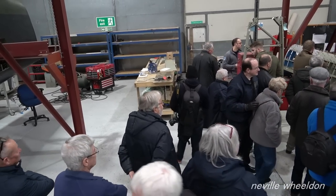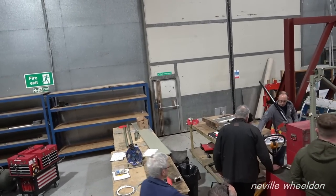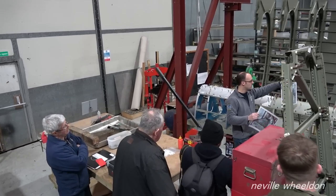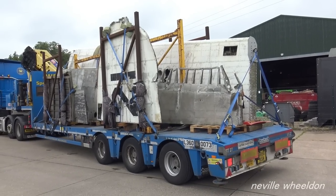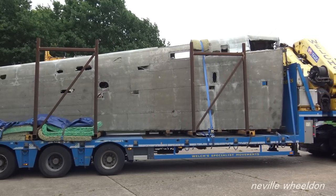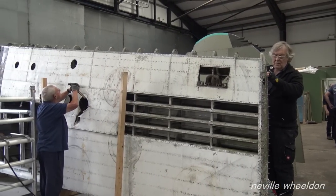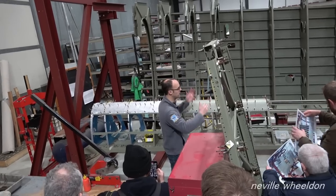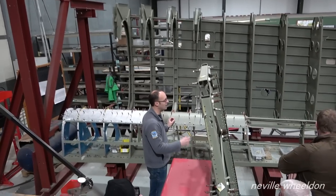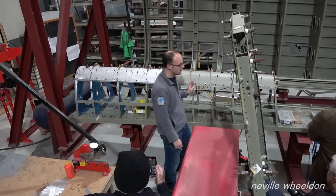That is the wing of NX664 W21, which we will restore and return to France. This wing came over from France — they hadn't touched it since the aircraft was recovered off Wallis Island after a bad taxiing accident following a landing. We built a jig, put it in the jig, and started stripping it apart. It suffered an awful lot of corrosion — normal skin corrosion and dissimilar metal corrosion between steel and aluminium. We've broken it right down into component parts and are building it back up. Because this is just for taxiing from a static condition, we've been able to repair things where on NX611 we would have to replace them.